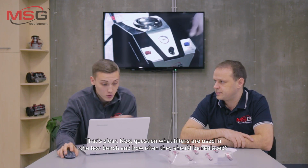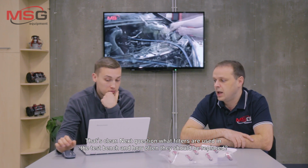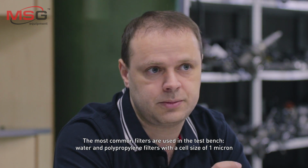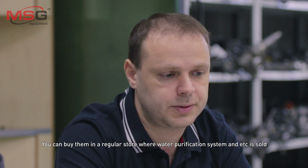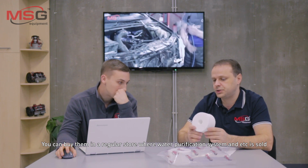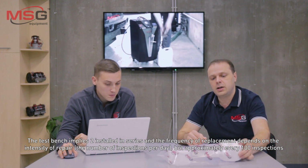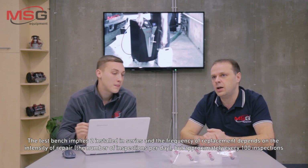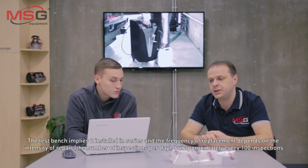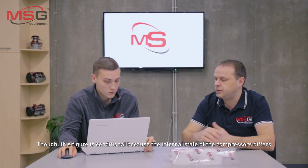That's clear. Next question, what filters are used in the test bench and how often should they be replaced? The most common filters are used in the test bench. Water and polypropylene filters with the cell size of 1 micron. You can buy them in a regular store where water purification systems and so on are sold. The filters are cheap. The test bench implies 2 installed in series, and the frequency of replacement depends on the intensity of repair and the number of inspections per day, but approximately every 100 inspections. Though this figure is conditional because the internal state of the compressors differs.